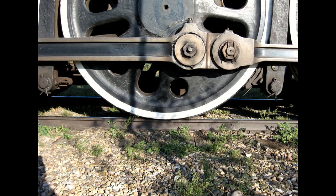Now, the reason for this is the same reason trains are the second most efficient means of transportation. The contact area of the steel wheels on steel rails is about the size of a dime. So literally, an entire train's contact with the rails can be the equivalent surface area of a coffee table. Now, that means very little friction, very easy and efficient moving of incredible amounts of weight, but the downside of very little friction and surface area is stopping that train. So we need to know what we need to do with the train miles in advance so we can take appropriate action to control the train. It can take 2 miles or more to bring a freight train to a gentle, controlled stop, what we call a service stop. So we need to know well in advance what's happening up ahead.